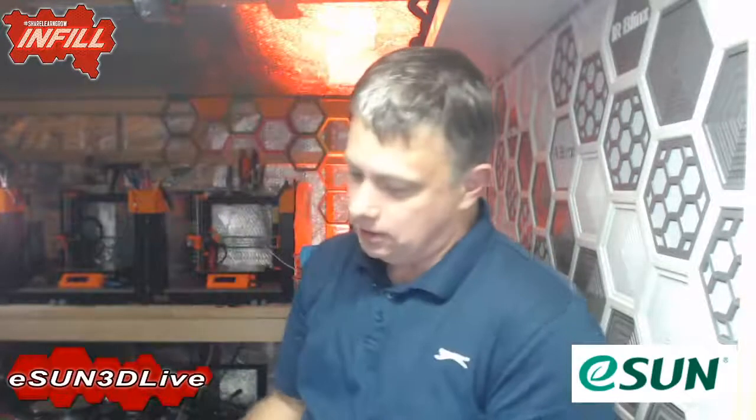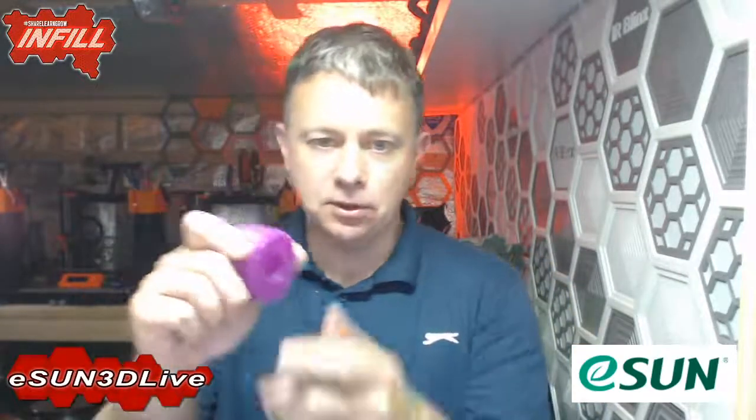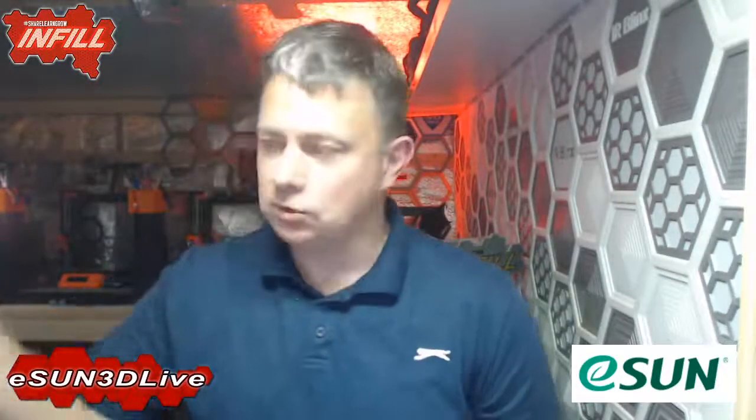So if I get the eSun TPU, the range it says to print is 200 to 220, and I was printing at 250, so that ain't gonna work. So basically, I was cooking the filament, and for all that you still get a decent enough feel to it. It's nice from a touch, tactile point of view. It doesn't look as nice.